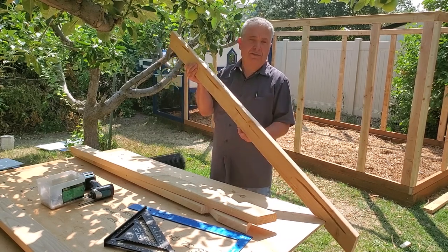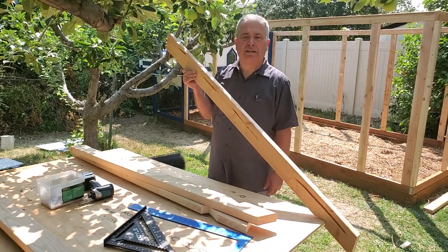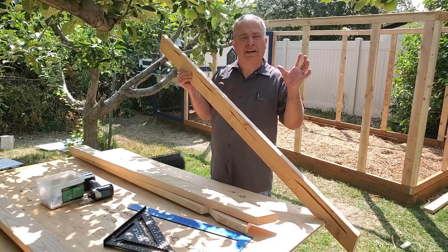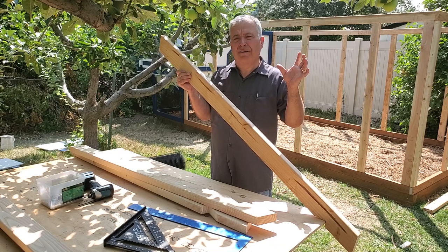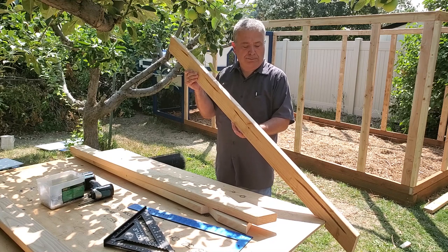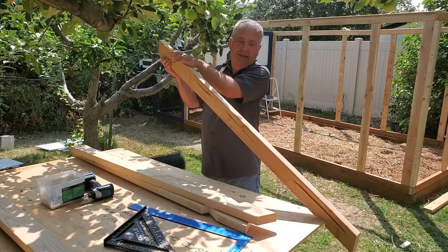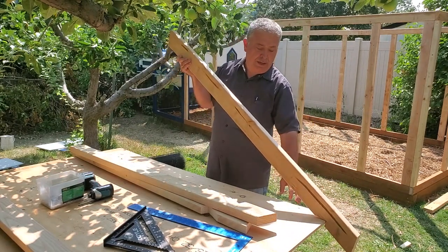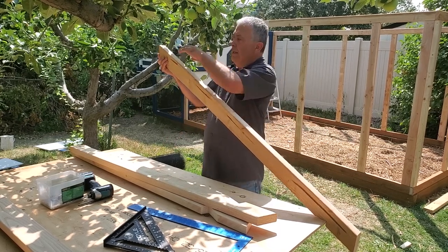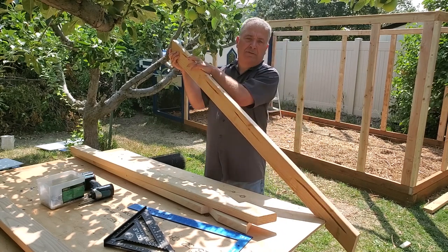So there's a theorem, and I never can say the name of the theorem correctly. It's a simple geometry formula. I'd have to see it spelled and sounded out. It's something like the Pythagorean theorem. Anyway, in those videos, they talk about it as well. Basically, if you know this measurement and this measurement, you can calculate this measurement. When I put my 48 inches and 20 inches in the theorem, it calculated 52 inches as the length of my truss.